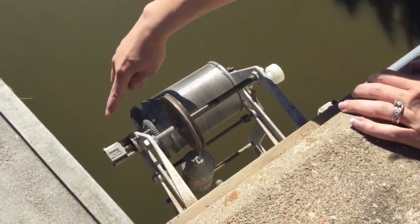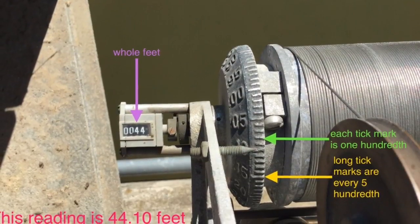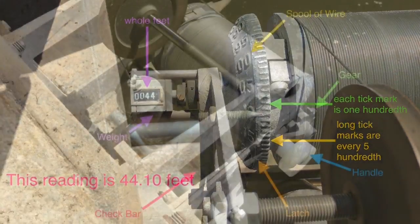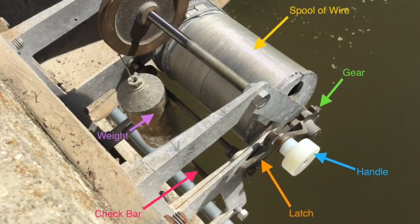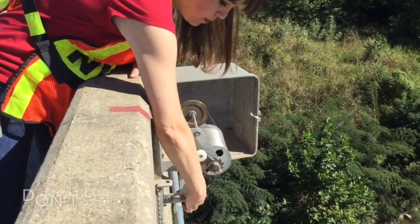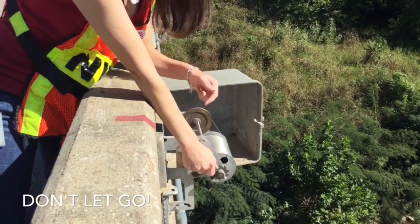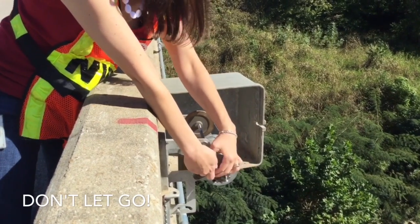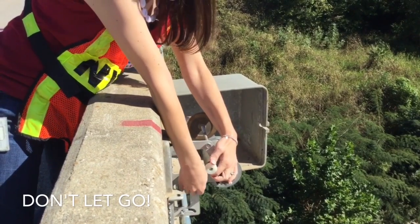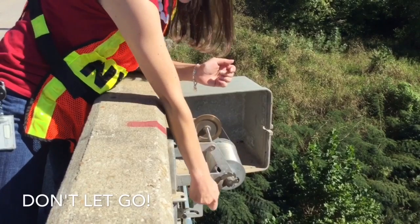On the left-hand side, we have where we actually make the reading. The first thing you need to do is push the check bar back out of the way so that there's nothing below the weight. While holding on to the handle, release the latch — definitely hold on, because this weight is heavy and it will quickly drop if you do not hold it carefully.